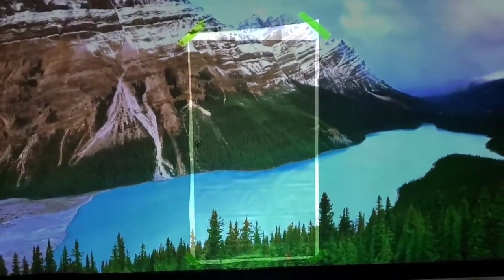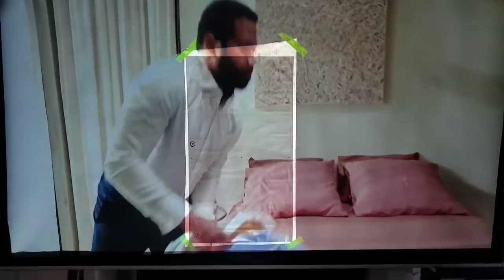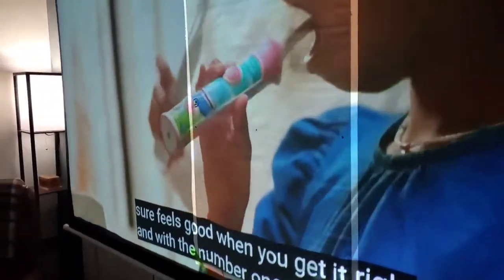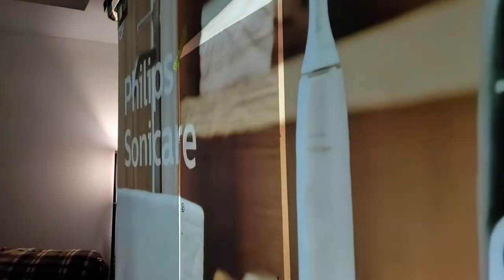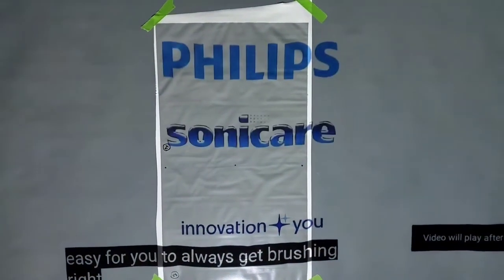Now, I haven't really highlighted a lot of it, but what you notice is you're not noticing any real difference there on that center line where we overlap. So you're not seeing any kind of prominent line that stands up. If you get up close, you can notice a little more texture in that area, just because we've got 8 coats there as opposed to 4 on either side. But you'll notice from a visual standpoint, you don't notice anything.